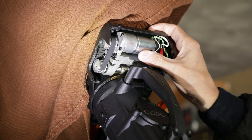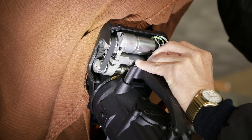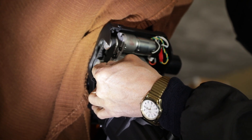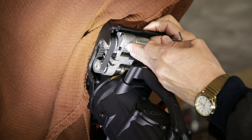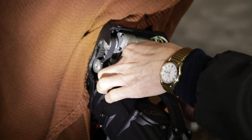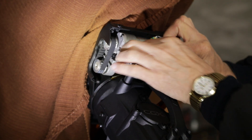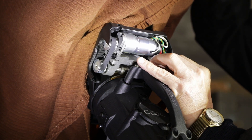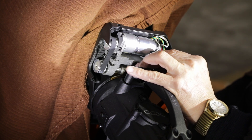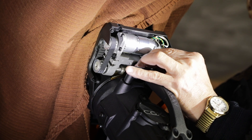What I'm going to do is start loosening up. As I loosen this up, I'm just jiggling back and forth — it's already starting to get better. I'm probably going to have to go quite a ways because I really knocked it out. You can see we're starting to pick up some movement up and down in the final adjustment. It's starting to tighten up — that is perfect. There is zero backlash in the system now.